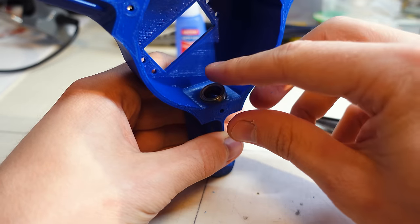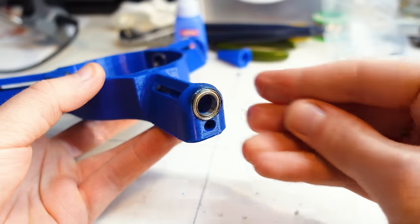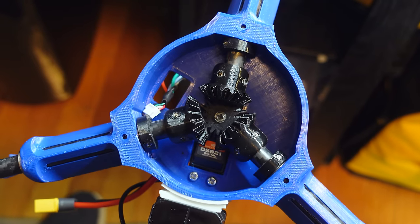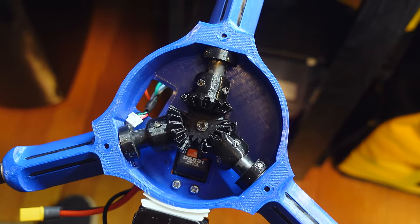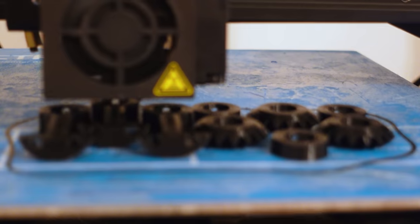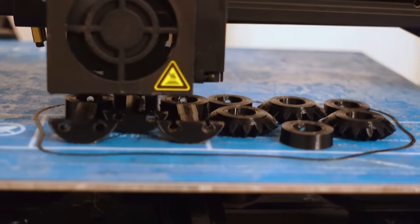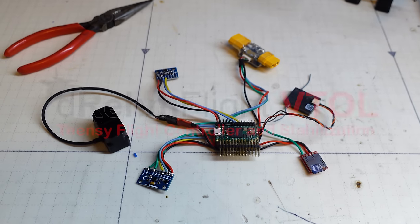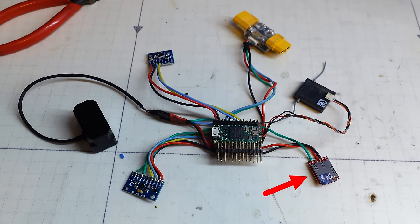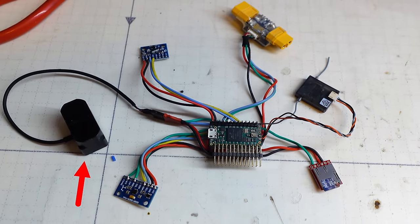This was a fairly basic drone build with a few exceptions. The center hub is 3D printed with bearings press-fit into the arm mounts to allow them to rotate freely. A single standard-sized servo at the center with a bevel gear actuates all three tilting arms at once. Out at the end of the arms, I have some regular mini quad motors with 5-inch propellers. All of the parts and print files I used for this build are linked in the description, if for whatever reason you want to build one of these flying abominations yourself.